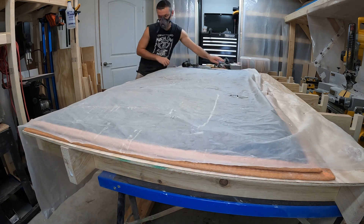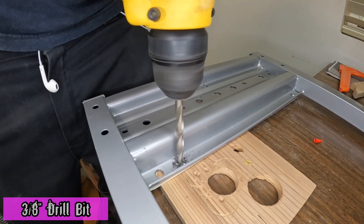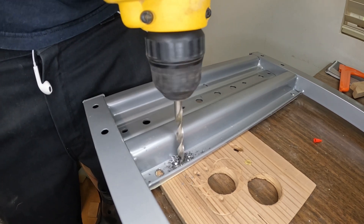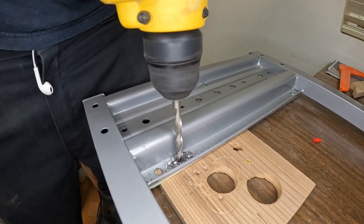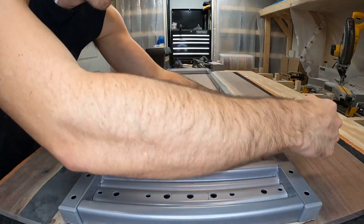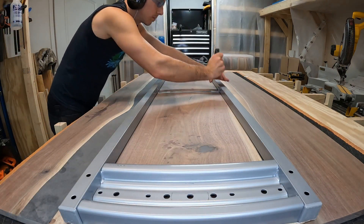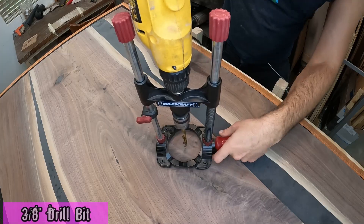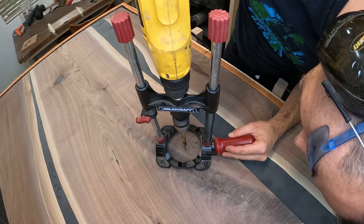You'll notice I was covering the slab in between sessions — I work on it on weekends, so it often just sits there. I like to cover it with a blanket and a plastic sheet to keep moisture levels even on both sides so it doesn't warp. I'm using a carryover base for the desk, so I had to drill out a new hole to make sure all the threaded inserts and fasteners go into the wood and not the epoxy. Marked all the hole locations on the underside so I can come back and drill for the inserts.